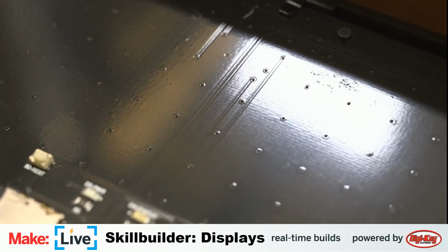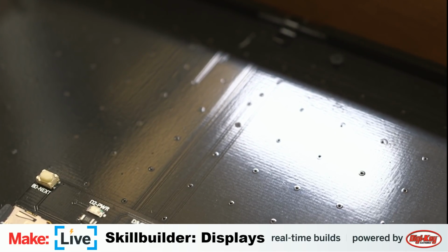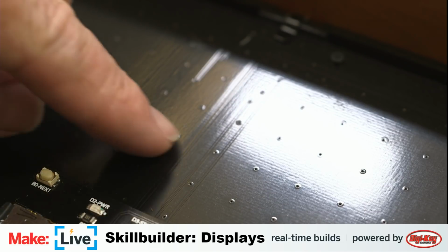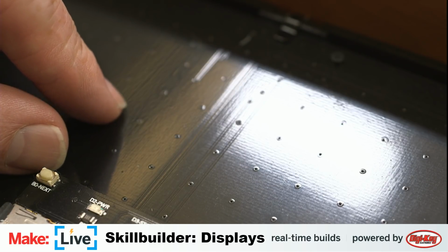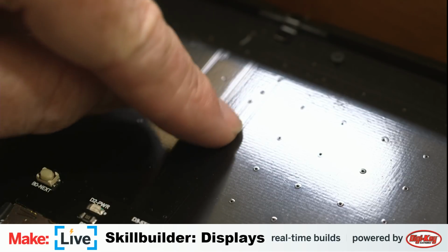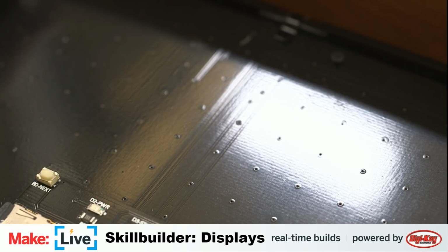It looks like there is not a ton of logic coming out beyond the base setting up the wiring. So I believe this is another one where they're all just streamlined together. Yeah, because really we have just a handful of traces here. So that would make sense, again, if these are just neopixels, really all you need is, you see these traces here. I don't know why this one would go to here. That's an interesting one. But again, you only have your 3 pins that you need to control, which is data in, 5-volt power, and ground. And you can just pass those 5 volts and power all along here.